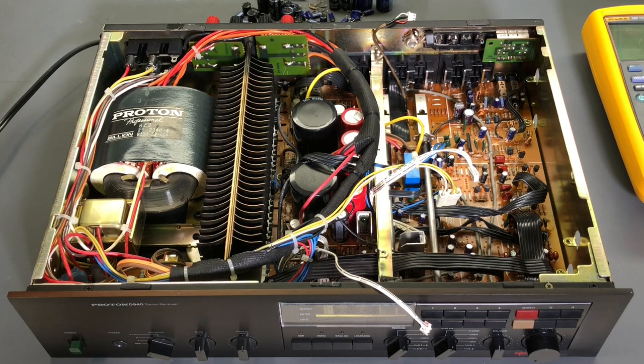The glue that was becoming conductive on the circuit boards has been cleaned up. Electrolytic capacitors have been replaced, and various other components — resistors and so on — that were being damaged by the glue or had corrosion have been changed out. Jumper wires on the circuit boards that had corrosion have all been replaced. The integrated circuit that's the main control chip on the tuner has been replaced, and the potentiometers and switches have been cleaned.